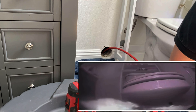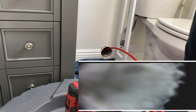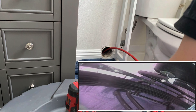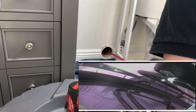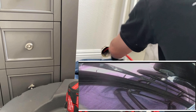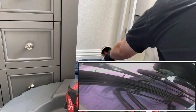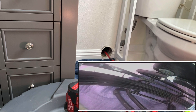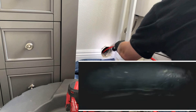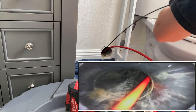The K9204 is a great machine — I love it. It unclogs more drains than any of my other machines anymore. I rarely take out the Model 81, which is my other go-to snake for residential. The little Spartan Model 81 with a quarter-inch drum and a five-sixteenth drum is the best residential cable machine you can buy. Team that up with one of these flex shafts and you've got an amazing little lineup of drain tools.